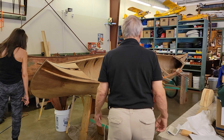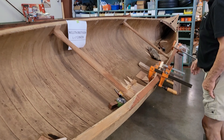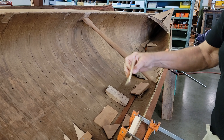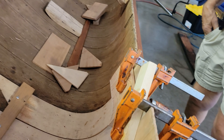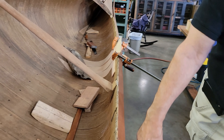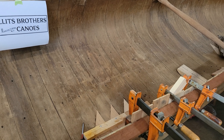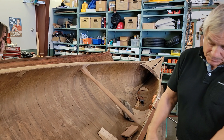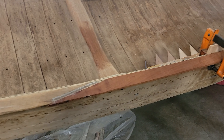It's kind of fun. You steam the wood and repair it - pieces this thin - and then steam them and put them in position and clamp them in. The boards underneath on the outside run lengthwise. They use a piece of cotton with pine tar in between to seal it, and then steam those too and tip those to the inside.